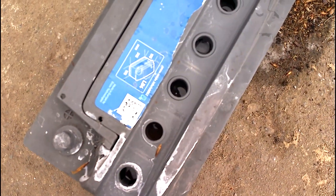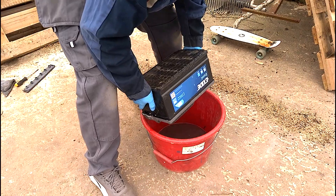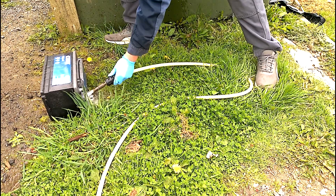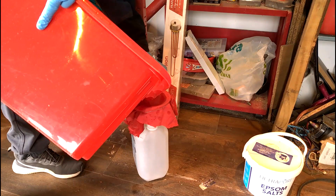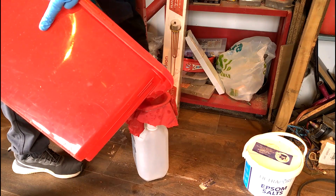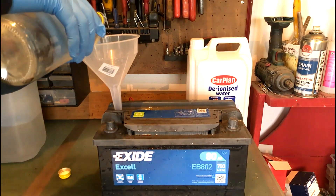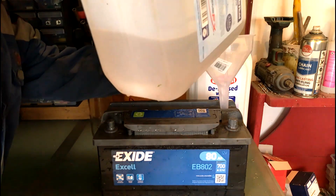About an hour and a half later it stopped reacting altogether, so I emptied it all out into a big bucket — the stuff that came out was pretty nasty, so it did seem to clean things up inside. After that, I washed it all out with the garden hose to make sure there'd be no further acid-base reaction. Once emptied and dried, the cells did seem a bit cleaner, although there was still some gunk in there. I took the old acid, filtered it through a rag and funnel to clean it up, then used the clean acid from the first experiment to fill the cells first, and topped up the rest with the filtered acid to about a quarter of an inch from the top.